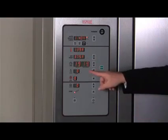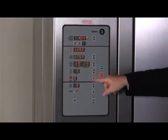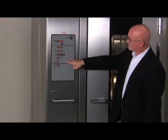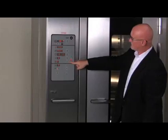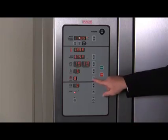The steam timer window displays the amount of time set for the steam cycle. Press the arrows to enter the steam time. The airflow delay button sets the circulation blower to delay airflow through the oven chamber at the beginning of a baking cycle. The oven will not heat while the airflow delay is operating. This is very helpful for delicate or liquid products that need time to set before air movement can affect the finished appearance. Press the arrow to enter delay time. The delay timer can be set from 0 to 9 minutes.